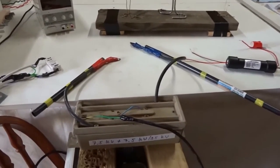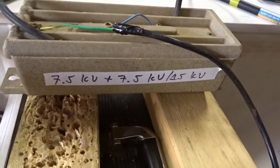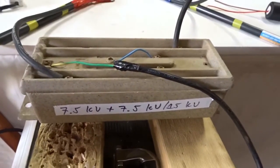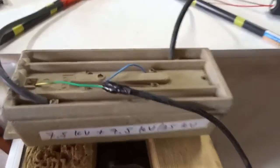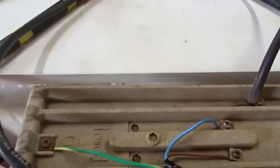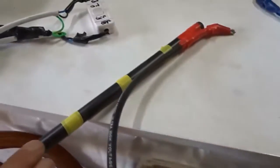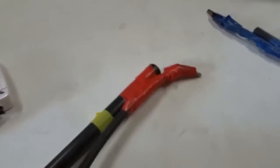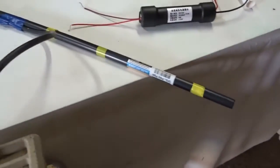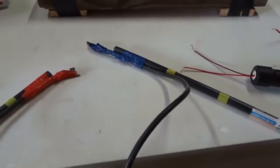or influence people. You have a neon sign transformer here, one of the big heavy ones, not the electronic ones, and it goes to about 15 kV, and that's a 15,000 volt AC power source. And here's the 240 volt AC coming in, brown and blue wires and ground. Now for the output, you never touch these output leads directly. You put them on long plastic pipes called chicken sticks and have a little clamp at the end. Never touch those things. So you want to keep your hands at least a foot away from the leads themselves. That's for the AC power source.